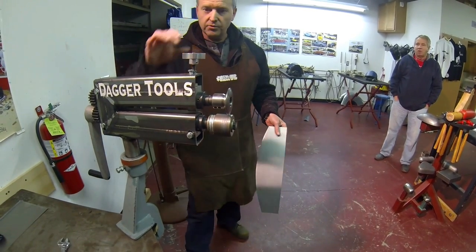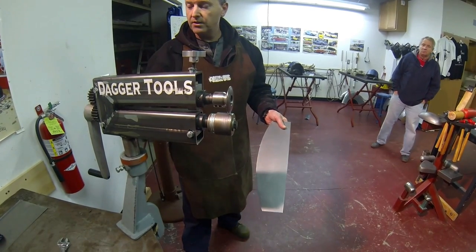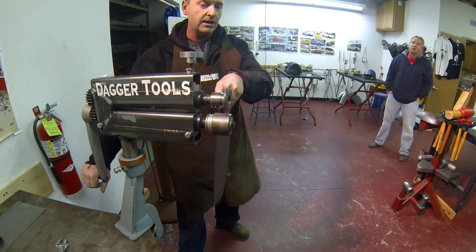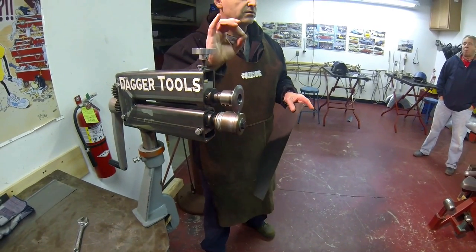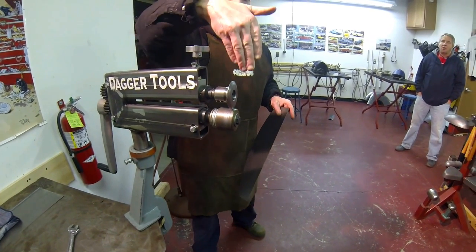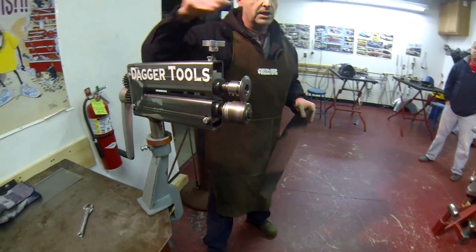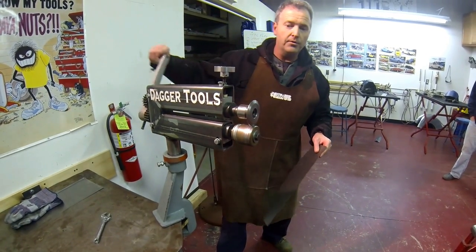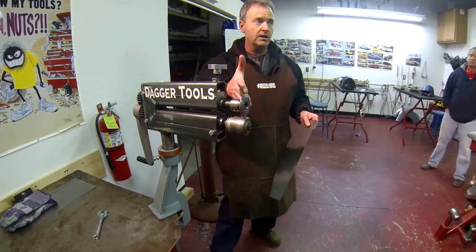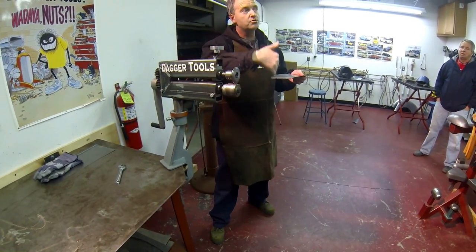Let's go through this again and set the pressure. Now that we have the pressure set, I want to be able to keep my eye on the point where it traps the metal. In my head I'm going to center line between the two. When I do a full stroke I don't want my head bobbing around because that throws my alignment off, and every time it goes off you track differently.